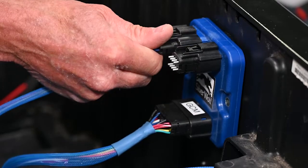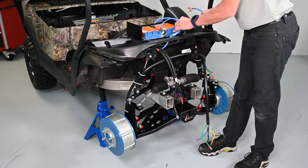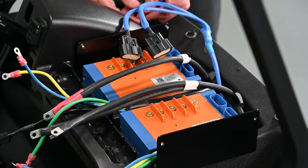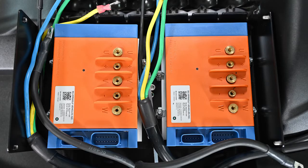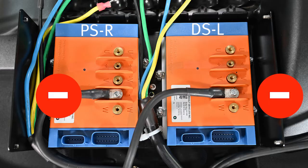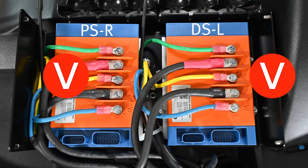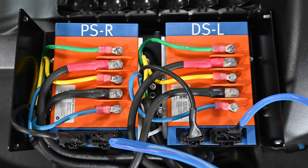Take the loose end of the Silverwolf main wiring harness and plug it into the Silverwolf GCM as well. The other end of the main wiring harness can now be fed up through the dash and into the motor controller box, just like the power cables. All the cables are now at the motor controllers and can be connected — both controllers will be wired exactly the same. The right controller does have a zip tie clip that ensures the communication wire stays snug. This is the sequence you will need to follow: attach the black power cable to the negative terminal, attach the red power cable to the positive terminal, fix the green wire to the U terminal, mount the yellow wire to the V terminal, and the blue wire to the W terminal. Plug in the small communications wire from the electric motors, and finally snap in the large connector from the main wiring harness. Ideally, the driver's side motor connects to the controller closest to the driver — this keeps the system better organized. When both motor controllers are connected in this manner, snug up the zip tie and you are ready for the next step.